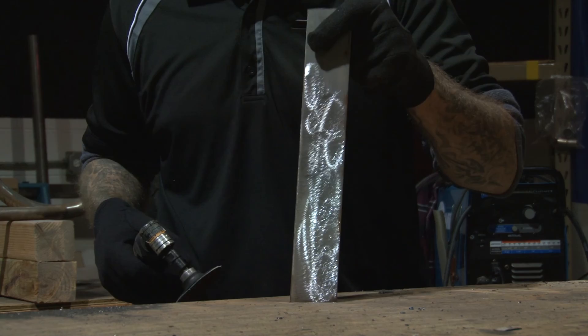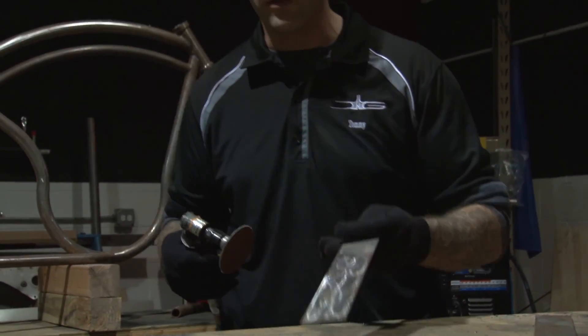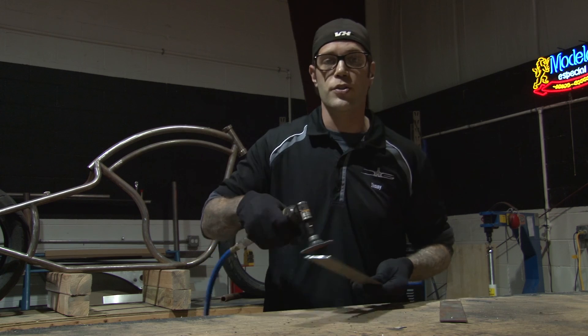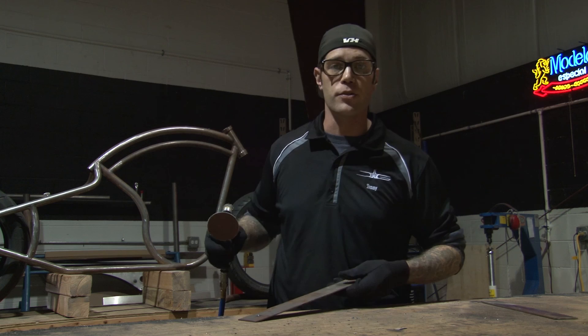As you can see, it takes off all the rust and all the contaminants, providing a good clean surface for welding. Also, a nice little tip and trick: when you're using an air sander, never just pin it directly into the metal. Go in a circular fashion — that way you will not get any dips or major grooves in your metal.